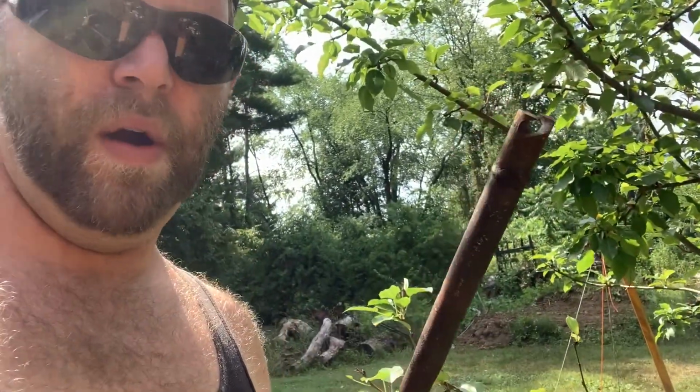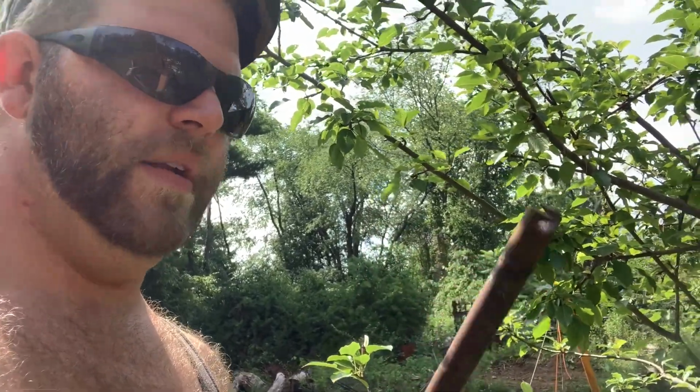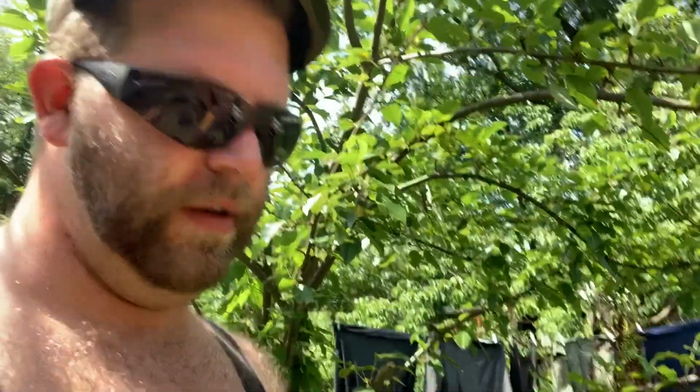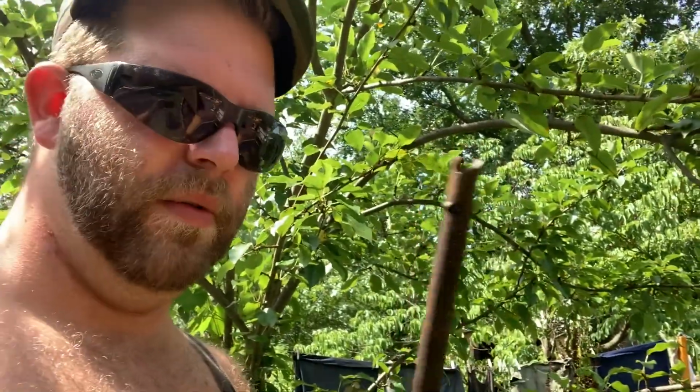It's not full hard. It's about as hard as a wrench would be. It's not as hard as a chisel, you know. I didn't want this harder than the cross pin and the crank, because then it's going to wear instead of this. So ideally, I wanted this just a little hair softer, and that's what we have.